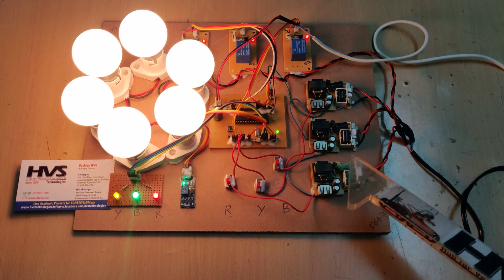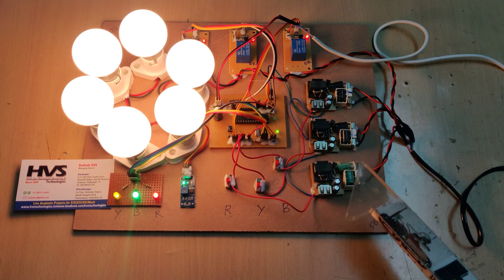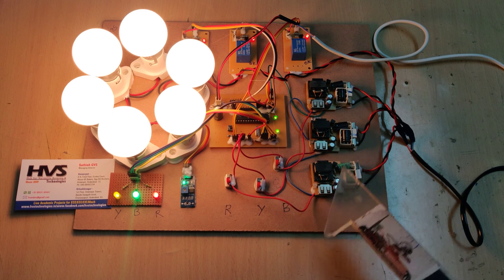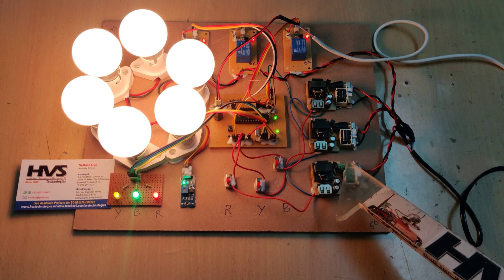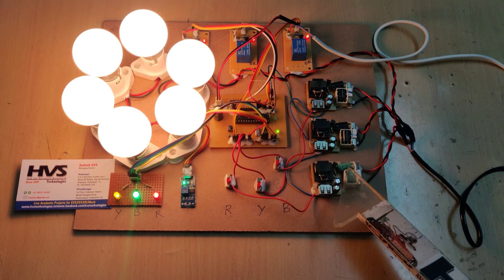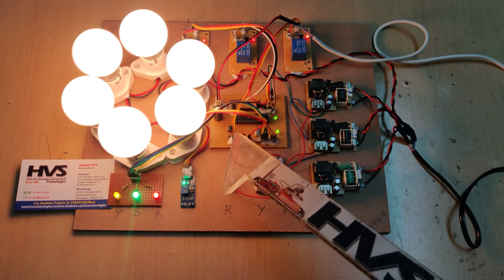The current sensing circuits have four stages. To measure AC availability of a particular phase, the microcontroller cannot directly measure AC voltage, so we convert AC to DC. First, the AC is stepped down from 230 volts to 2–12 volts AC using a step-down transformer. Then a rectifier converts 12 volts AC to 12 volts pulsating DC. Capacitors filter out the pulses to produce pure 12 volts DC. Since the controller cannot measure 12 volts, a 7805 voltage regulator brings it down to 5 volts DC. So the full chain is: 230V AC → step-down → rectifier → filter → regulation → 5V DC available to the microcontroller.